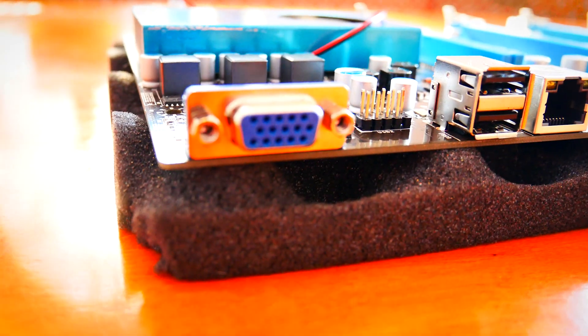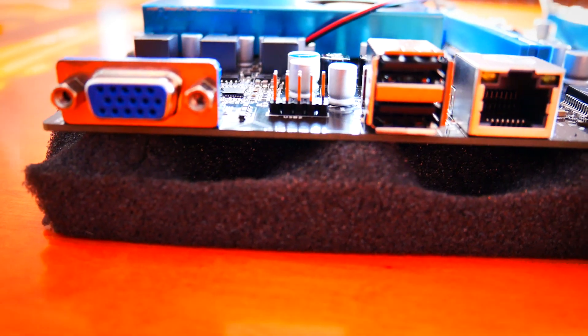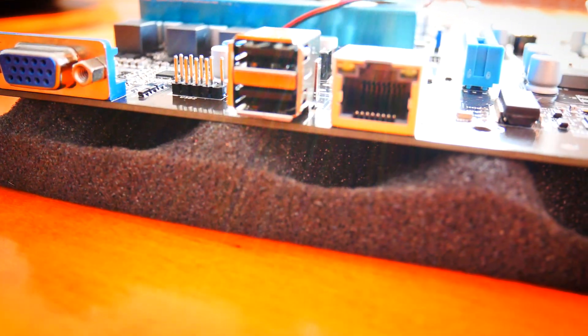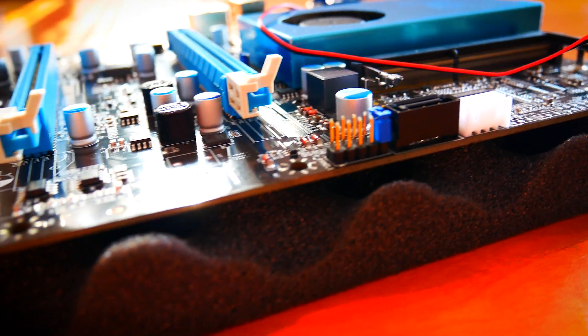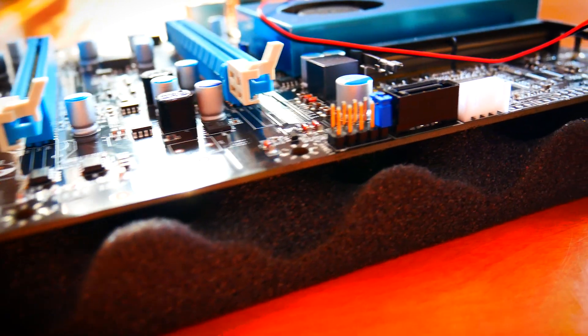Let's take a look at the connectors. We have some basic slots like VGA, a USB 2.0 header, two USB slots, and an Ethernet NIC. On the other side we have our SODIMM RAM slot — the same RAM that would go into a laptop — as well as a SATA connector which we won't need, and the header for our case or power buttons.